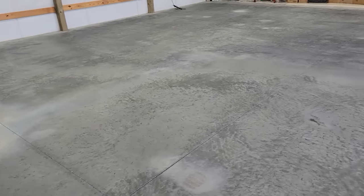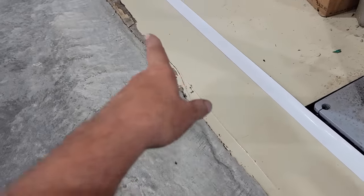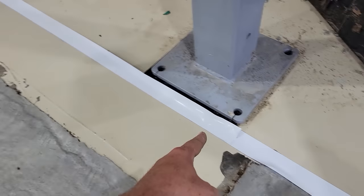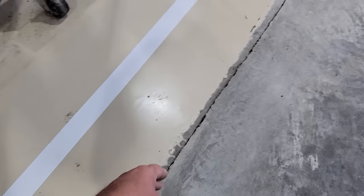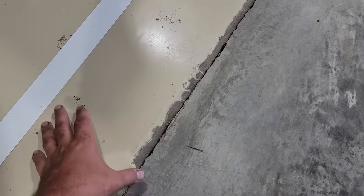It's going to look so much better. It takes about three to four days to dry. There is one really tricky part here — trying to match this color floor to the old color floor. I'm told they're going to do their best but they're not going to be able to get it exact. The other issue is there used to be a wall here, so the epoxy flowed and built up a big ridge there without actually doing any concrete grinding. So here's where our post was — this is going to be a pretty big lip unfortunately. I've requested the new color to go to this line so we can at least get these caps taken care of, but I guess it's just something I'm going to have to live with rather than pay a bunch of money to have someone come out here and concrete grind all of this smooth — maybe sometime in the future.